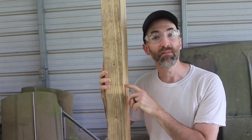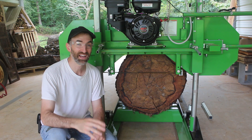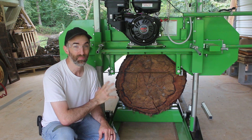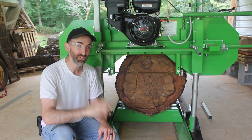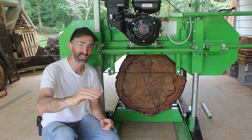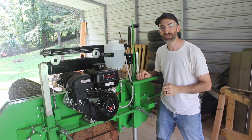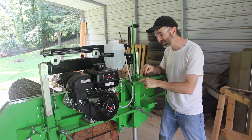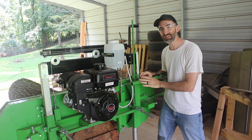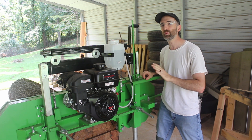This gantry worked great — if by chance you're interested in building one of these, I'll put a link to that video in the description. Now just like a few other times during this process, I'll run into another snag. The log looks way too big for this sawmill in its current configuration, but I have learned a couple techniques that raise the sawmill up just a little bit so I can get that first initial cut. This is the Harbor Freight sawmill and the main limitation for height is actually the push bar — that's what helps you control it going back and forward during the cut. If I remove it it becomes very unsafe, so what I'm about to do I do not recommend, but I'm just showing you what I did to make this cut.